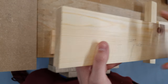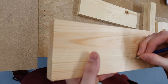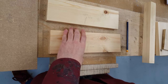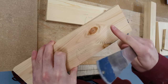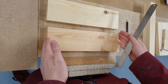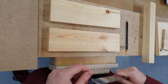And then this one, by default, will be right side. As you can see, there is still a knot on the right side of this piece. If I take my steel rule and measure according to the working drawing dimensions, this knot is not going to interfere with the position where I'll be marking out and cutting the through housing joint. It's always worth checking the timber for any knots, seeing if they're going to be in the position where you might be marking out and cutting a joint — and if they are, try to mark it out on the opposite end of the timber.